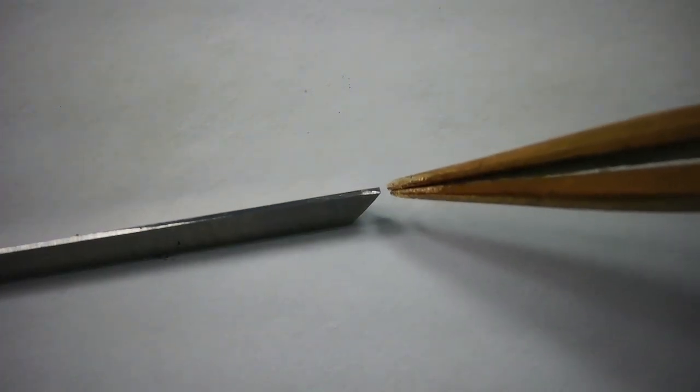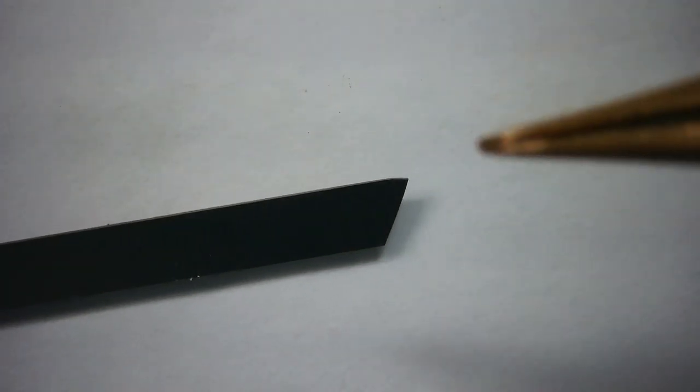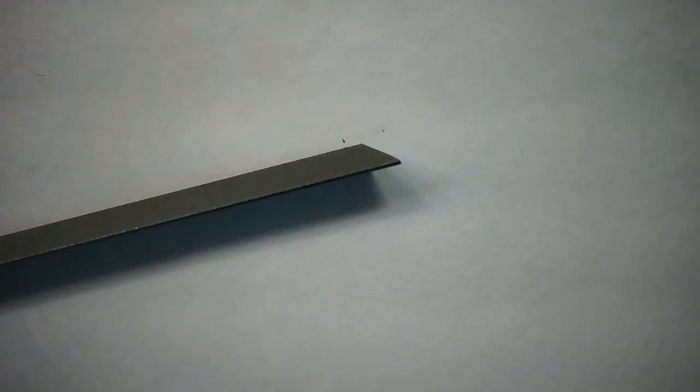As I get closer to fitting the part — whether it's the balance or the roller table — I use this graver, which has a two millimeter width and is flat. That's used to finalize the cut. I do not use this for the pivot. This other graver is two millimeters with a rounded tip, and it is used for the conic shape of the pivot — when I've completed the pivot I do the cone shape as it tapers in or tapers out from the point of the pivot to the larger part.